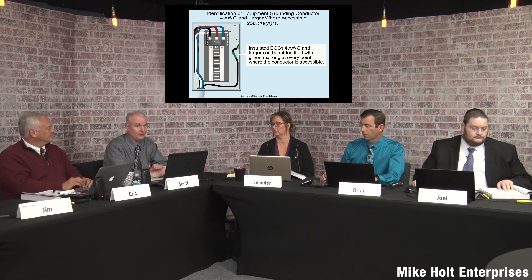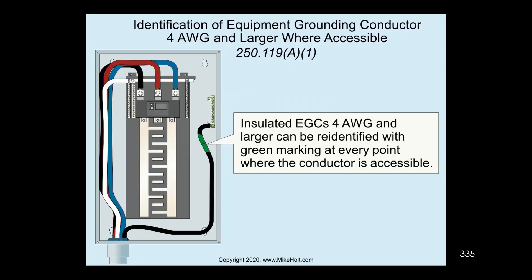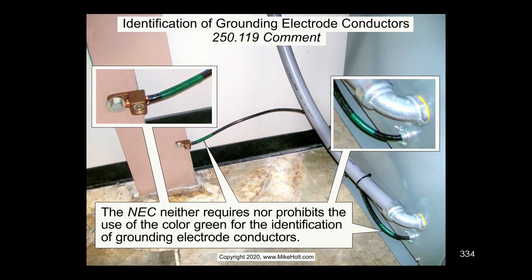Are you getting silly situations where people say we really need to have that conductor labeled? What else could it possibly be? I'm guessing someone didn't connect a phase conductor to that structural metal. People get caught up in labels, but this is a process of elimination — it's pretty obvious what this is. If an inspector says 'how do we know what that is, you've got to label that wire,' well, it's going to the steel column, it's coming out of a transformer, it's a grounding electrode conductor. Some inspectors might want you to label it, but it's not a code violation.